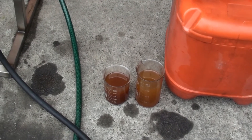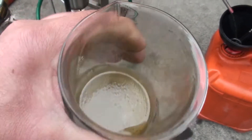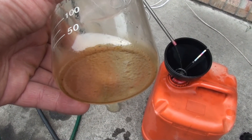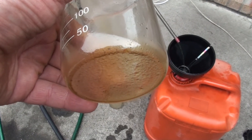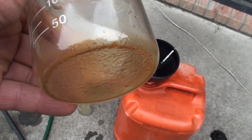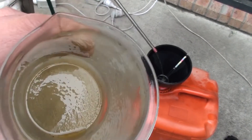Here's the result. Now I just wanted to show you — I just emptied this cylinder and you can see it's been sitting for a while. The fuel that we got, the distillate after the first distillation of the oil, started to deposit some tar, asphalt, and polymers on the bottom of this cylinder.